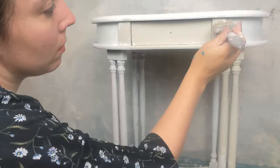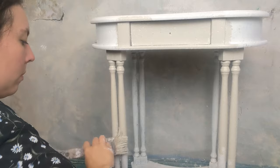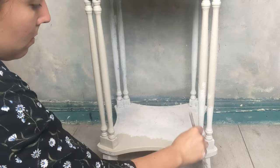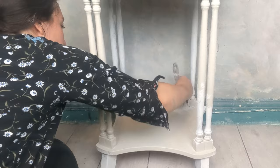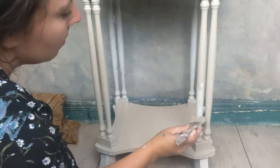The colour I've created is a much more muted version of the Sandcastle. I didn't want it completely grey and I didn't want the very beige look of the Sandcastle either, so by combining Wharf and Sandcastle together it's almost created a kind of burlap — maybe even a French linen sort of look — and it's going to help give it this very faded antiquity, manor-house style. If you are stippling your brush, just make sure you're using a chip brush you don't care about too much, as this does really wear your brush out, especially when using sea spray.